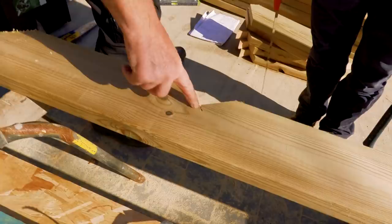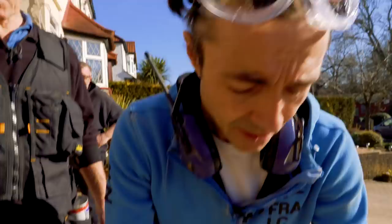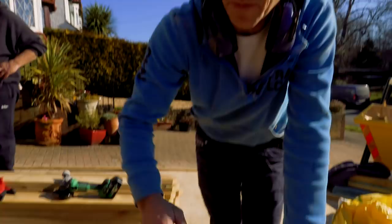You don't mind that little overcut there - they do it, yeah. You don't want to overcut right through, but this is an oversized rafter structurally for what we're doing - look at the span, it's nothing. The reason we're using this size is because you're going to have 100 millimetres of PIR insulation there, with airflow underneath and airflow over the top - breathable membrane or a vented fascia board.